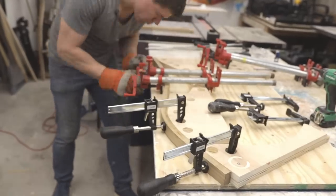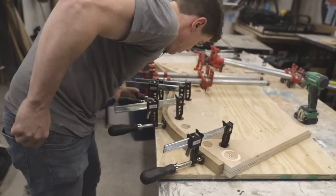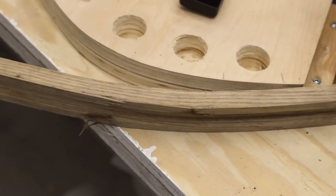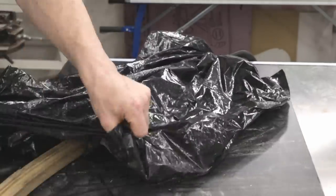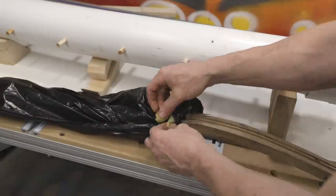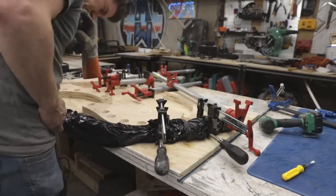The oak was definitely bending a little easier than the maple, but on the bend back I started to see a little cracking. I kept my cool this time and realized the crack wasn't too bad, so I decided to try stabilizing it with super glue. I also decided to test a technique where you use a plastic bag as your steam chamber instead of a wood box or PVC pipe, testing it on the already-cracked piece so I wouldn't waste another new piece of wood.